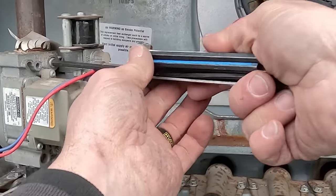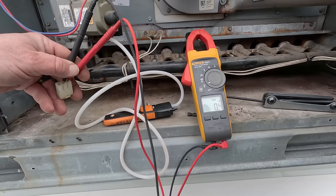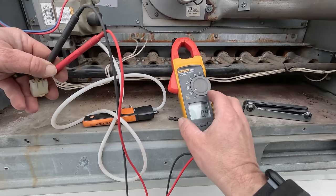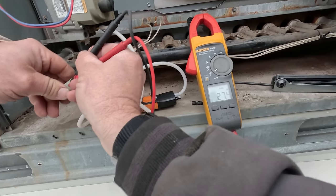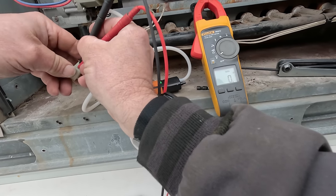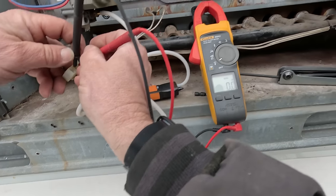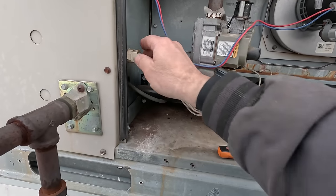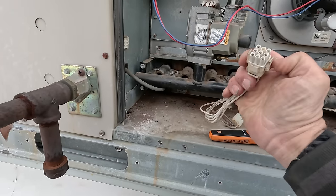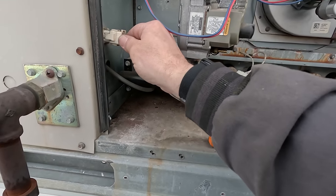That's an inch over the three-and-a-half mark — it ain't great but it would work. This is a two-stage valve, which makes me wonder: are we getting power on all terminals so it's firing on high and then dropping to low? Obviously the gas valve is not going to open because we don't have the plug in. We got it on W1, nothing on W2. I don't know what the normal order is on this, if it normally does two at the same time, and if this thing's smart enough when you jump them together it's not going to work right. We jumped over W2 — nothing. So we only got it on W1. These plugs can be garbage. Unplugging this is going to trip out the limit and give us a false reading.